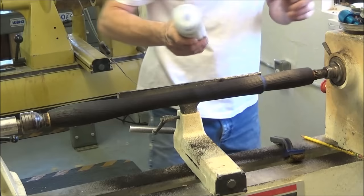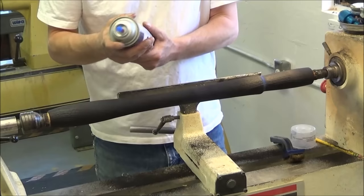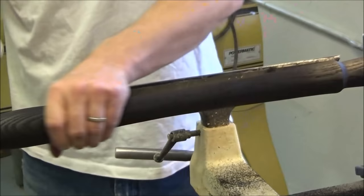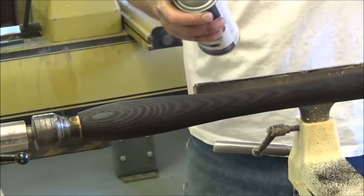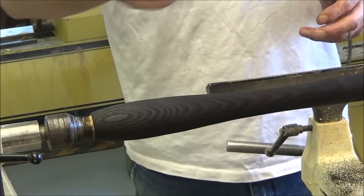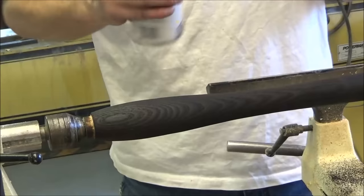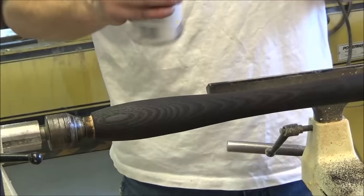So there's the handle all waxed up. I'm going to use Deft — good product, nice quality spray nozzle on that. Give it a good shake. Don't spray with a cold can because you get spitty bits coming out. Warm it up a little bit — maybe put it on the windowsill for a few minutes. Don't put it in the microwave. It doesn't work.